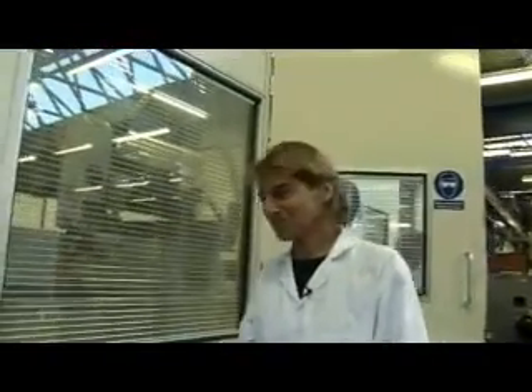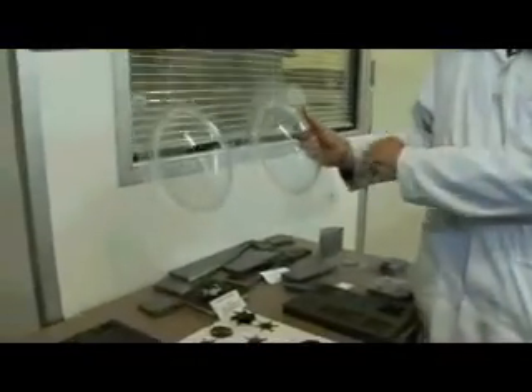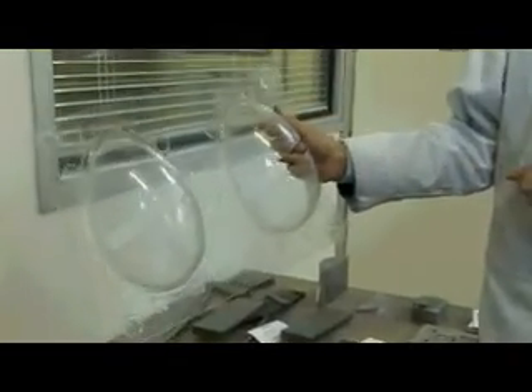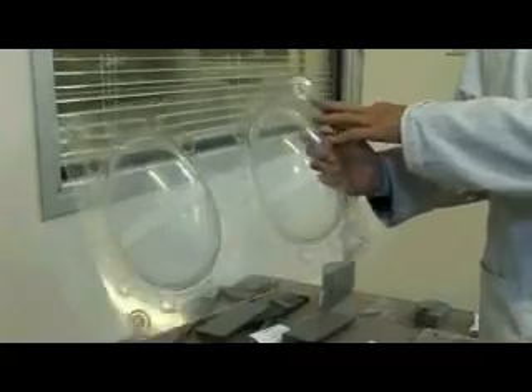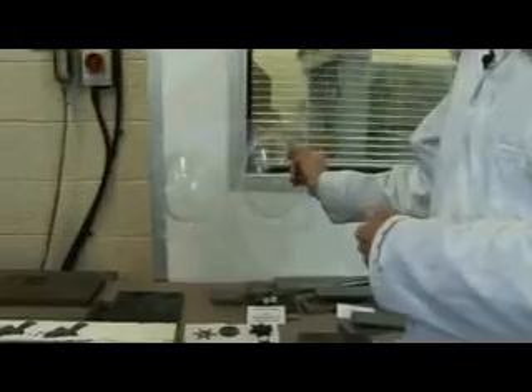This is our display board — the most interesting piece. This is the Easter eggs display for Thorntons and we cut this strip out for them. This stuff's called Lexan, it's polycarbonate and it's quite difficult — you can't cut it with a laser because it just chars, so the water jet was pretty good for doing that.